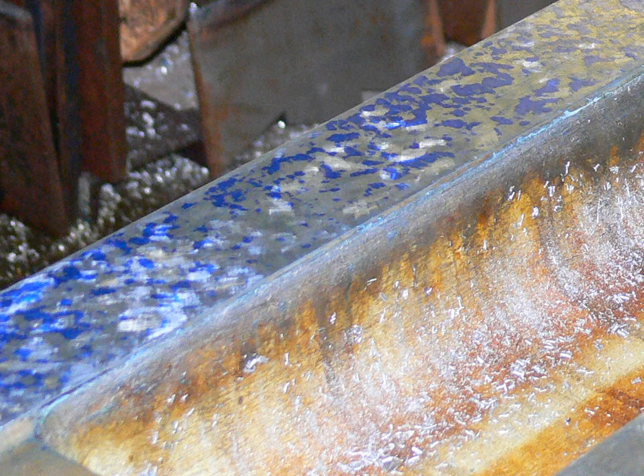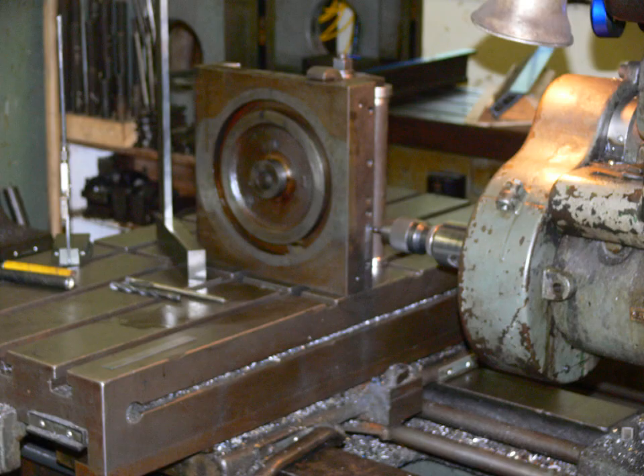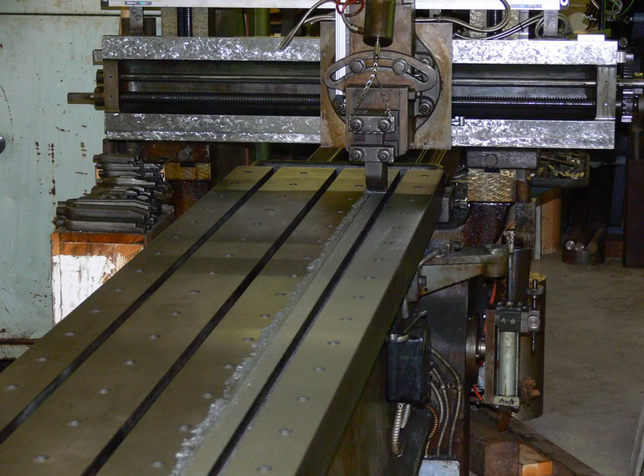The surface is now ready to begin the finished scraping that will be visible. The head had no oiling system to speak of, and so after using a shaper to machine the head to fit the rail, I drilled some oil holes and made some oil grooves on interior surfaces. This required the addition of three oil cups.